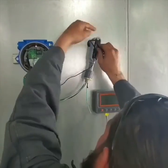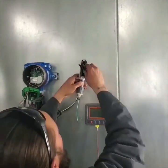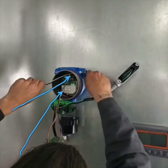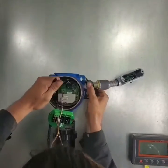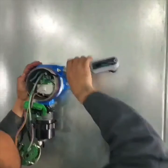Tony's going to get this through, and now you can see he has it from this junction box, through the flex seal, and actually into our sensor. He's putting the second set of wires through now, and now he's going to tighten it up.